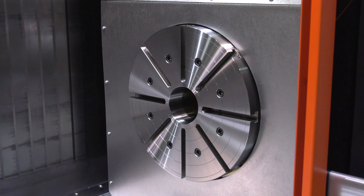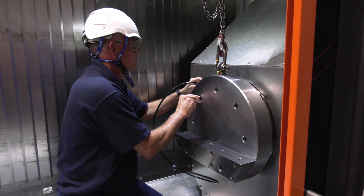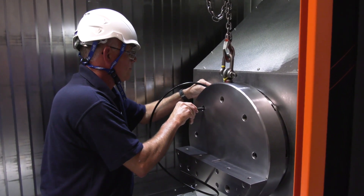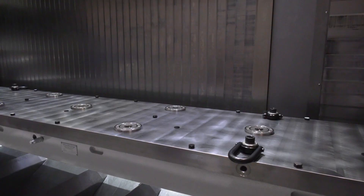And why do you think that is — what does this machine tool offer your clients? It gives them a large machining envelope with a five-axis capacity, and in the SDR version, six axis. You've got what look like two fourth-axis rotary tables at either end, and we've now mounted the zero point trunnion to those, which makes it back into a fifth axis because you're synchronizing the fifth and sixth. Correct — the fifth and sixth axis rotors at either end are connected by a table and synchronized together.